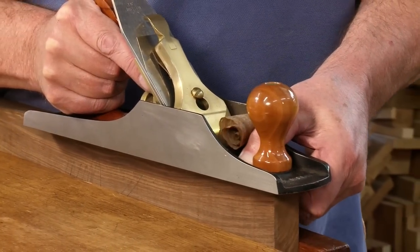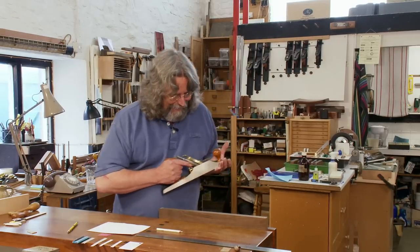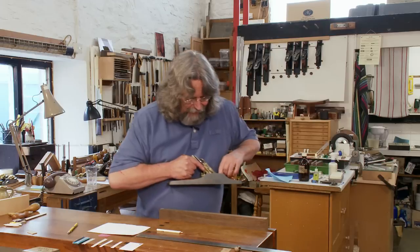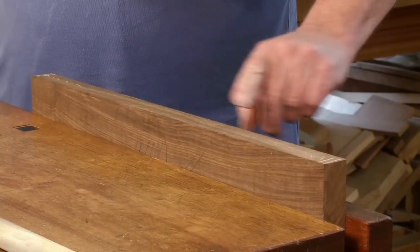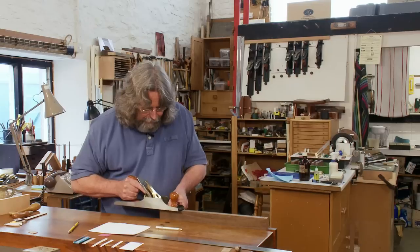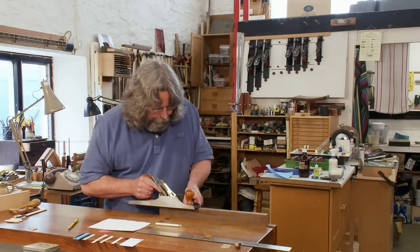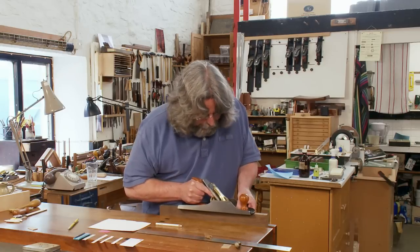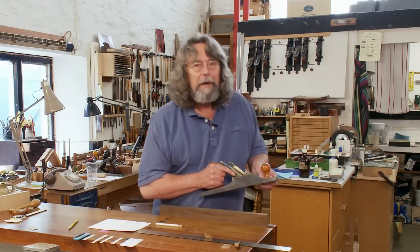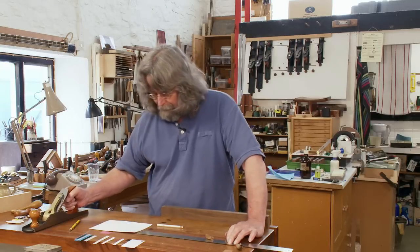When I'm doing this I can actually open that hand completely. It's only at the end that the thumb is released. Do you see — it stopped cutting there and it stopped cutting here, and in a few more shavings it will in fact stop cutting altogether. I try to use my legs as much as possible — my arm is jammed against my ribs and I rock backwards and forwards on my legs. There — stop cutting.